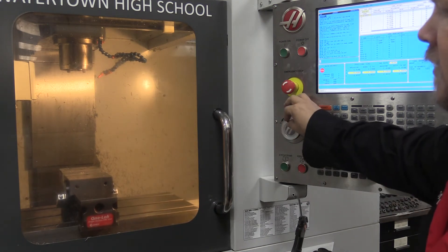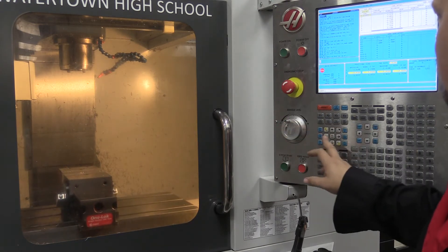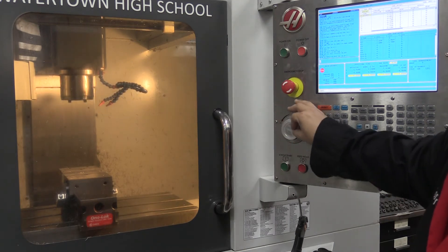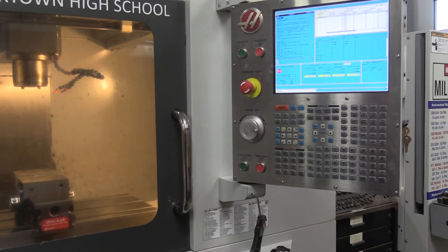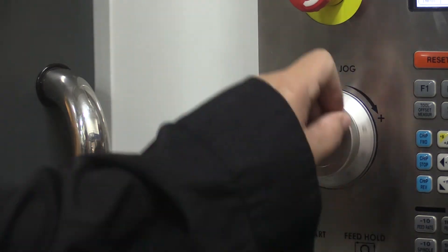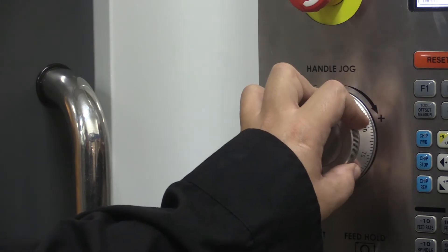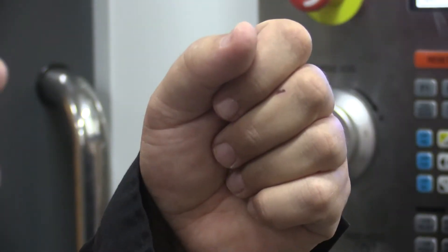On the Y, still at 10 thou, the table moves backwards and forwards. Then switching to Z, you can see the spindle coming down and going up. The hand wheel has a knob on it so you can easily grab and spin it, which is nice for fast moves. However, anytime we're in the Z direction and getting close to the part, I want you to grab the outside of the wheel for more control.